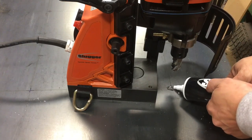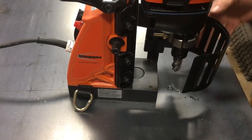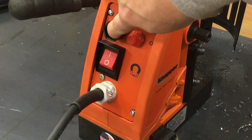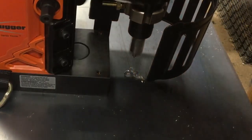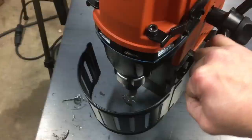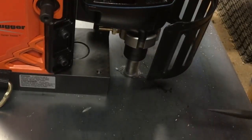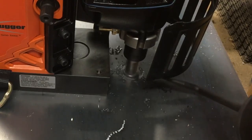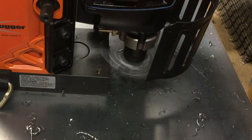It is very important to use a cutting paste or lubricant to keep that cutter head cool during operation. For safety reasons, the drill will not power up unless it has proper magnetic holding force on the steel it's drilling. With over 2,000 pounds of holding force, you won't have to worry about this drill releasing from the steel when you're applying ample pressure on the cutter head.